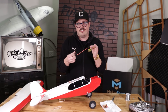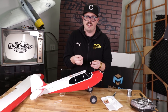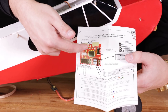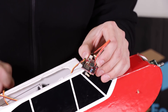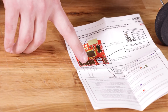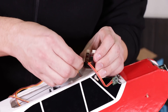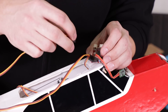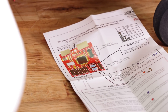Now that our receiver is soldered to the Aura Lite and our model is set up, we're going to install this into our aircraft. Looking at the manual, S1 is throttle, and the signal wire goes on the top pin facing the front of the aircraft. S2 is left aileron, S3 is right aileron — always make sure your signal wire is going up towards the front of the board. S4 is for the elevator and S5 is for the rudder. I'll go ahead and plug all of those in.